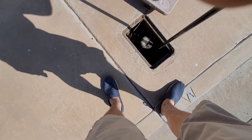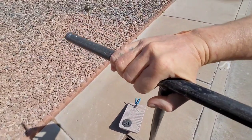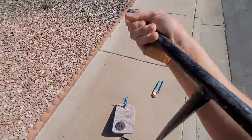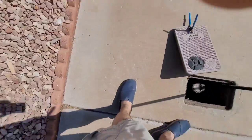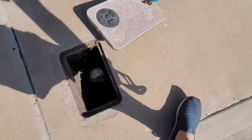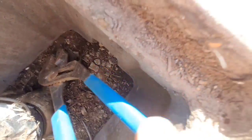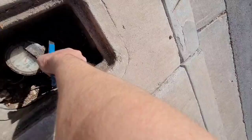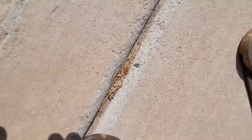I mean, you can't always, but a lot of times you can. Or like a crescent wrench with channel locks on the handle. Some sort of combination. You can pick up a water key at Home Depot or Lowe's for pretty cheap. And you just go ahead and turn the little valve inside there to the right, and usually there's little eyelets and they line up, and the valve will stop.